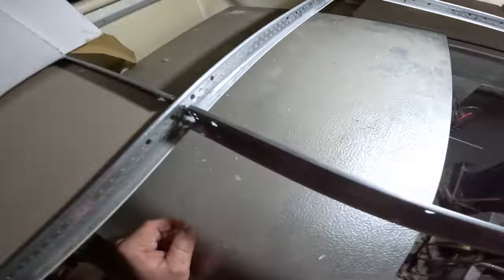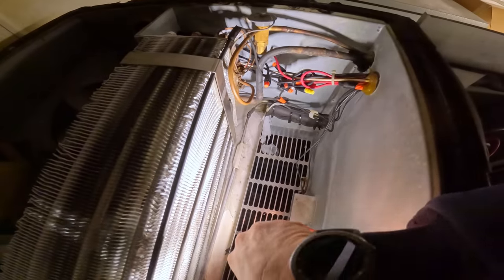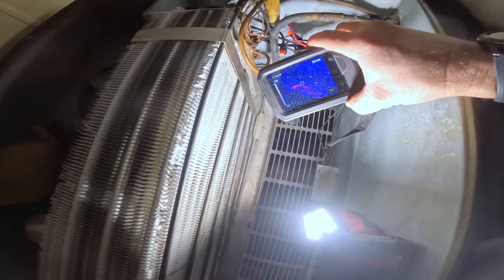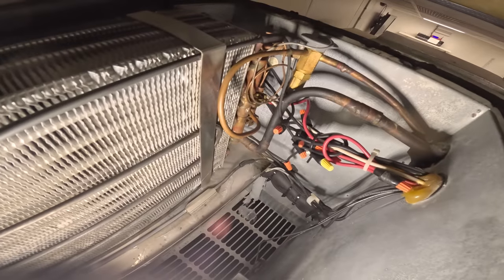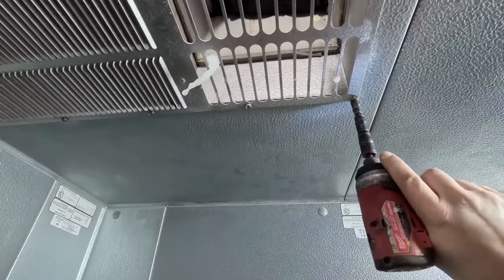Now we're in a spot where we can get some eyes on this thing. We've taken half the ceiling apart. You can see we've got heat tape right there that appears to be working. The elements are working — it's pretty obvious. You can see the heat tape is working like it should. The drain line is completely clean and clear, there's nothing in it at all. But you can see the thing is leaking right along that drain.